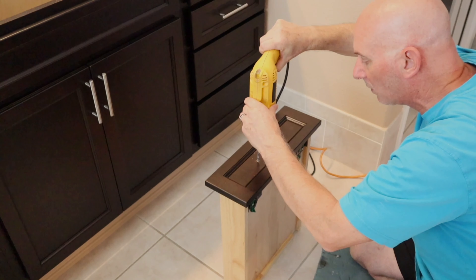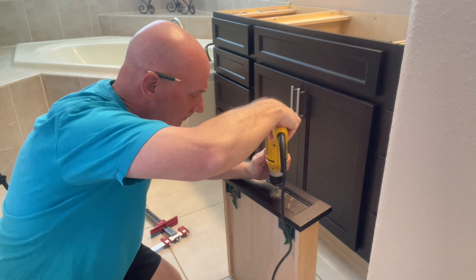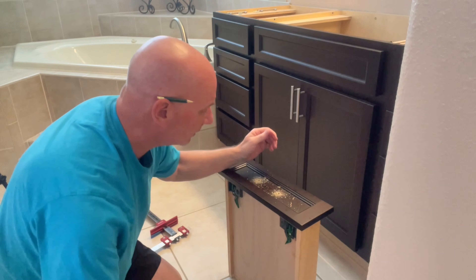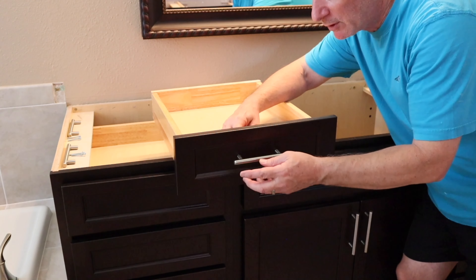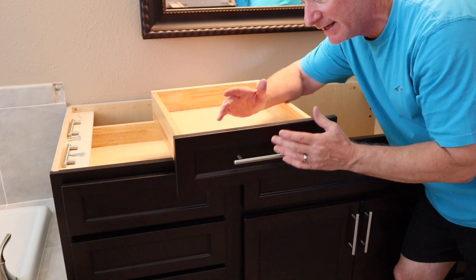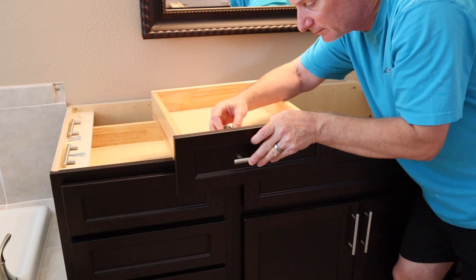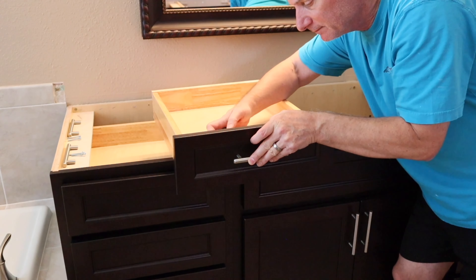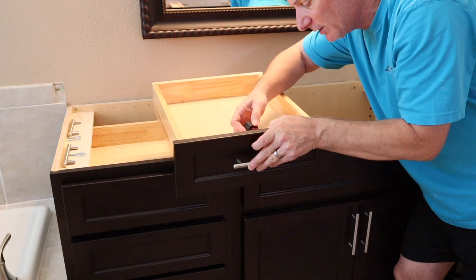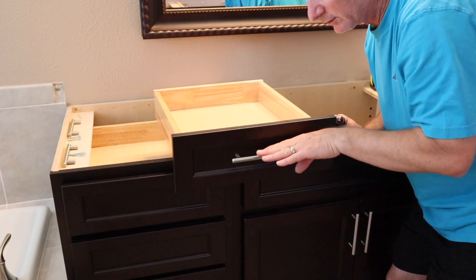I have my pilot hole through both parts, and I have a slightly wider drill bit so I have more play with the hardware. When you go to do this, you don't want to just commit and plunge right in because you'll tend to splinter the finished side. You kind of have to just touch the surface lightly — you can see it's not splintering. Now I can plunge down into the material and it's not going to splinter. Same thing on the other hole — just touch the surface of that hole first, then plunge in. Very important for the finish side.